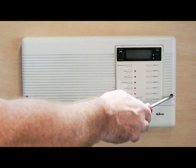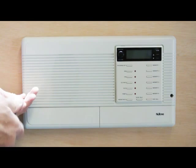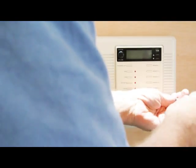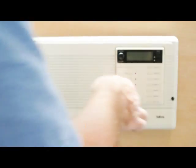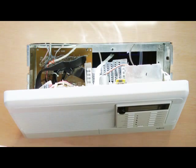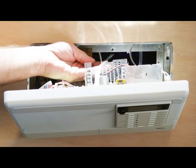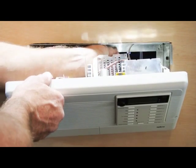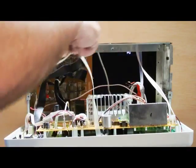The first step is to open up the master station. There are two screws that go through the face plate — take out the left one and the right one. The master station will slide forward and fold down. The bottom is held onto the wall housing by two hinges and will be supported by a support strap. At the far end inside the wall there's a hook, so if you tilt it up just a little bit and wiggle it out of its hole, the master station will fold down further, making it easier to get to all the connections on the back of the unit.